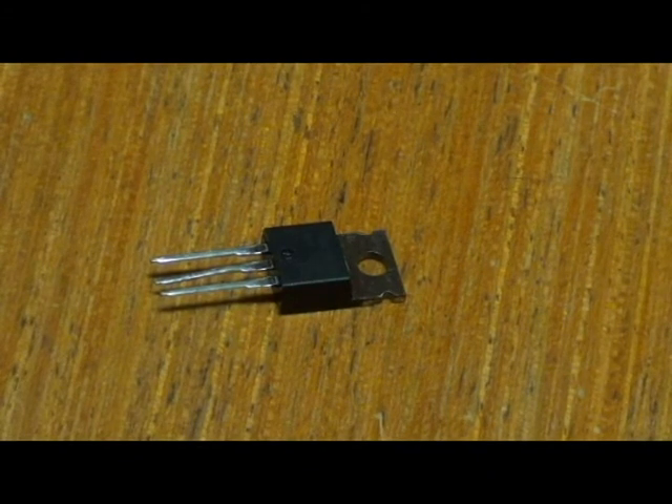It is used for DC current — don't try this with an AC source. MOSFETs have both voltage and ampere current limitations. It can handle up to 60V and the amperage is limited to 30A, so this works only up to 30A.